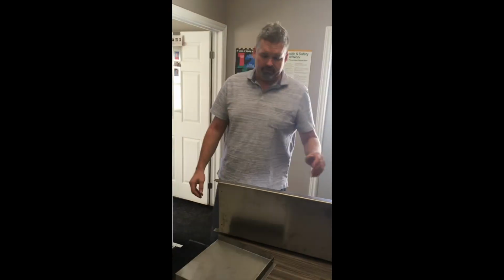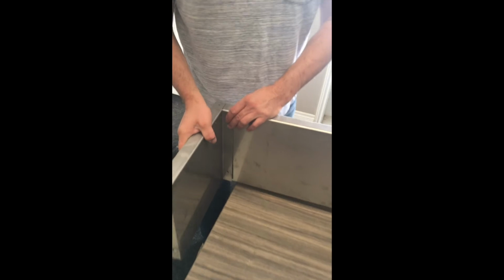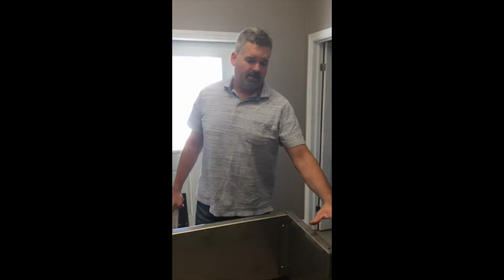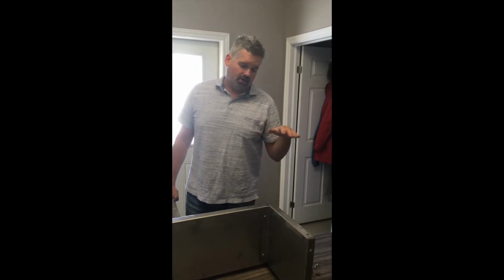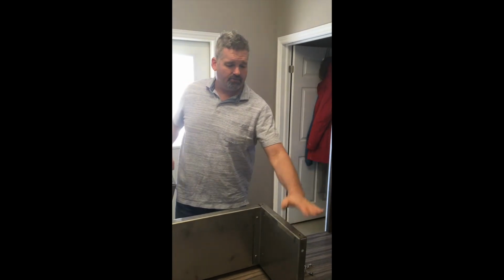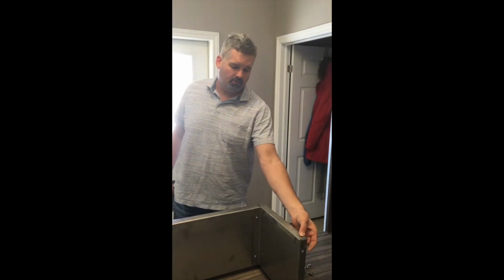In this case, we are only making one 12-inch section. So you would come here, you would do the same thing again, set it on top, put your bolts in, everything else. Notice how on the top though, I didn't put the top bolts in yet. If you were building another section on top that you would join, having the right side, you would put the next section on top and you would bolt everything together at once.